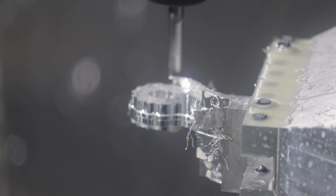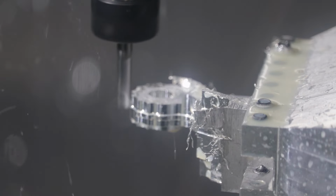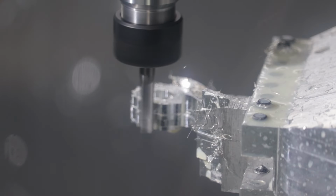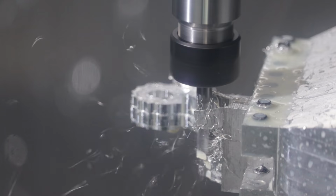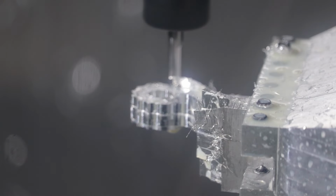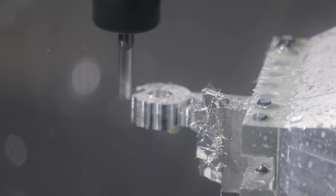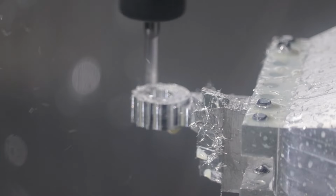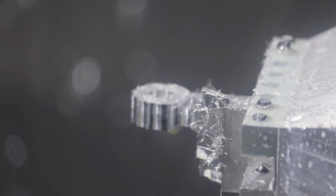We're using the face of the 1/4 inch end mill, which is about 6.4 millimeters, to just hog out the mass that would be between the gear teeth, and just get us ready for the 1/16 end mill and the swarf cutting, which is always fun. 5-axis swarf cutting. We're following along and cleaning up the rest, and then we're hogging out the extra material that was on top of our lever arm on the backside too.